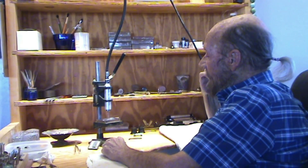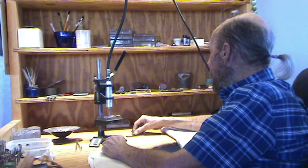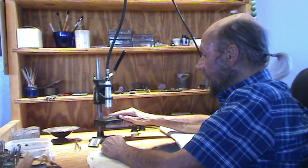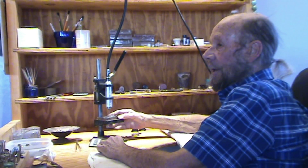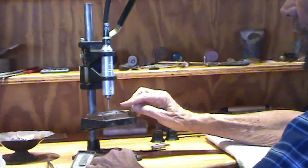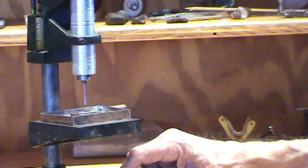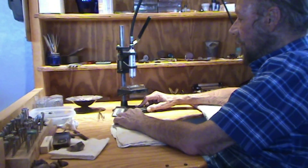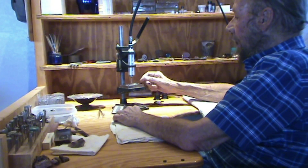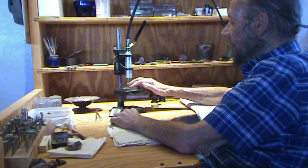The only place that the drill drills is the face of the drill. There's diamond on the sides on all of them, but the sides don't really cut. The part that's making your hole is the face of the drill. So if you're getting ready to drill and you look at the face of your drill with a loupe and there's little to no diamond there, don't even bother putting the drill in your chuck — it's not going to work. Once we get drilling, I'll give you some demonstrations on how I utilize all of this stuff. But those are insights on diamond drills and how to ruin them.